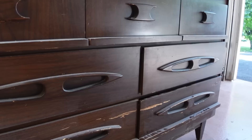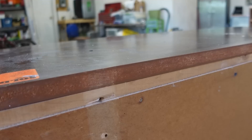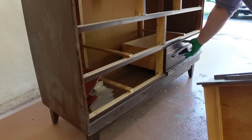As soon as I saw it I fell in love with these really unique wood handles, and I wanted to fix it up and give it a fresh finish but still keep its really groovy 70s aesthetic. By taking a quick look at the back of the dresser I can tell that the body is MDF and laminate veneer over a particle board structure, but the handles, the drawer fronts, and the base are all solid wood — probably maple. So I'm going to refinish those to showcase the wood hiding under this faux wood sticker, and then paint the rest of the dresser that is laminate in a very 70s color.